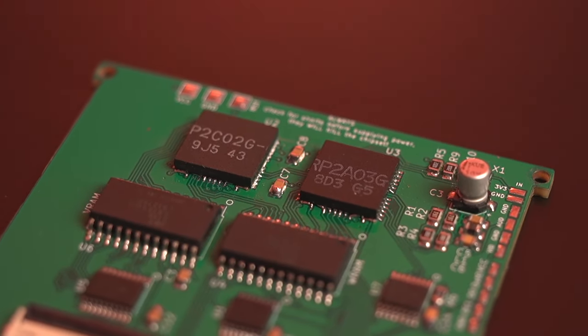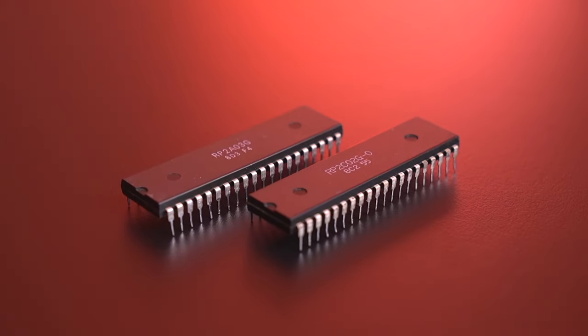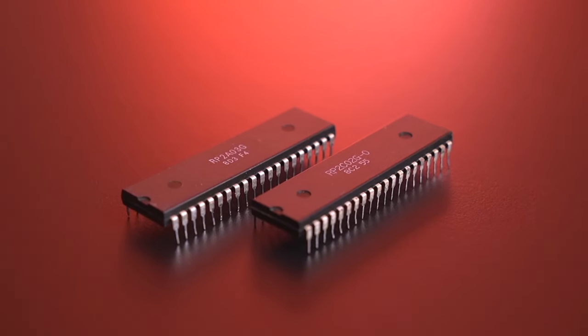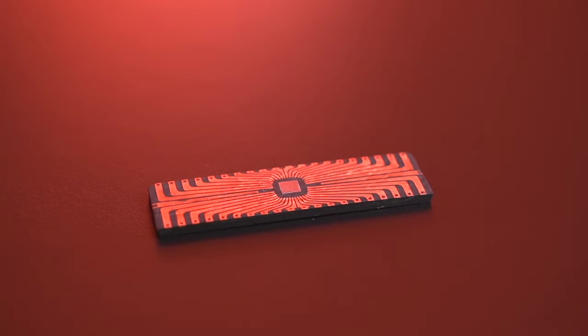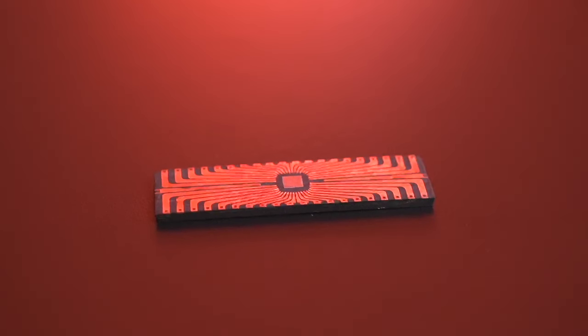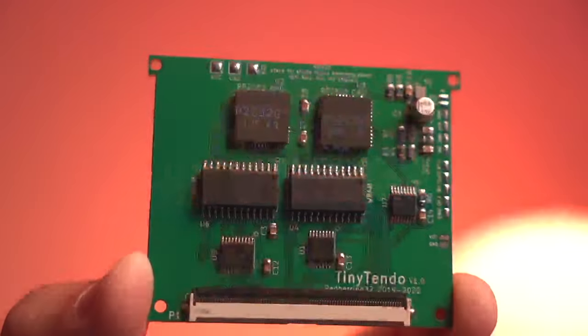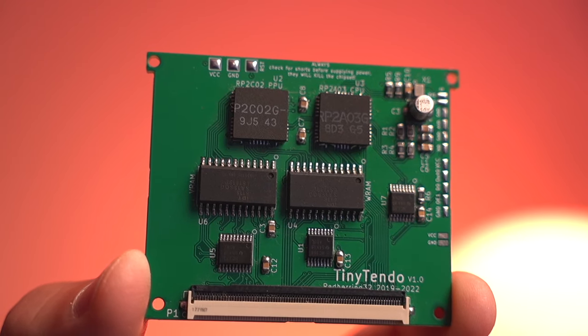After many failed attempts, he finally had a breakthrough, and was able to get the two chips down to a much smaller footprint. And the key to everything was the discovery that the bottom of the two chips could be sanded down, exposing all the leads, as well as the die itself, and still be fully functional. This allowed him to surface mount these chips to the motherboard and keep the overall size of the board much smaller.